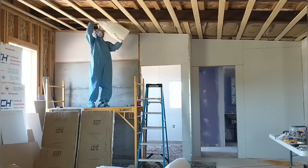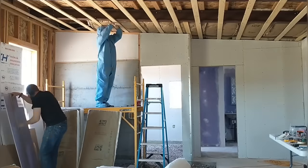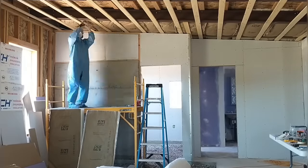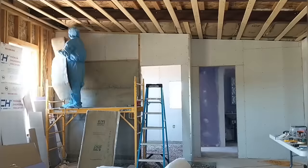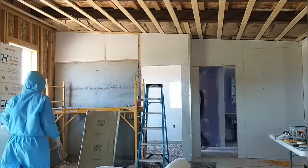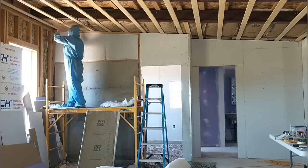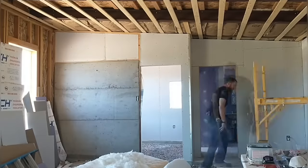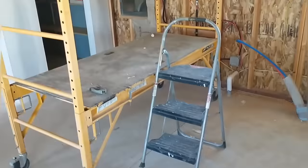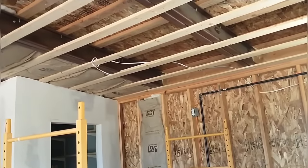She's putting in those large batts of 10-inch thick R30 insulation in the ceiling. It's really exciting to get this insulation in and get this drywall up — it just feels like a big step in the progress of this home. She's tucking it up underneath that wall and in and around these beams. One thing she's really careful about is not getting the insulation folded over as she's tucking it in — it can bunch up and you won't see it unless you stick your hand in there to make sure it's flat. This scaffolding has been working out great — we can move it around and it makes a great platform for April.